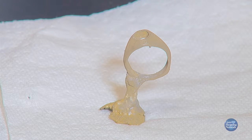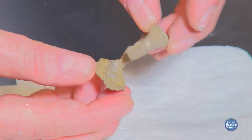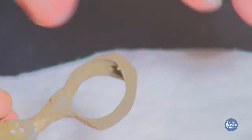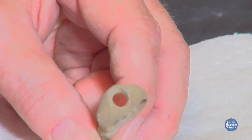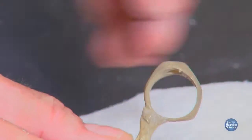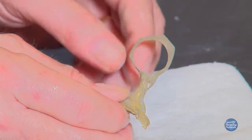Here is how it looks after it's cast. We've taken the wire brush and removed what's called the investment — the white material we put around it. This is a fantastic outcome. There are only a couple of little bubbles underneath; those occur when you're pulling the vacuum on the investment and they get stuck underneath, but that is minimal — you can get a lot more. So I'm very pleased with the outcome. We have a complete cast. What we do next is we saw the sprue off and start finishing it.